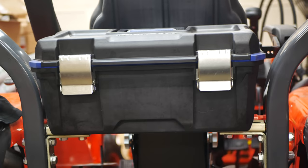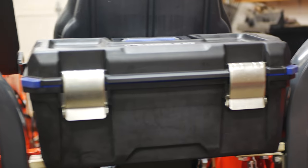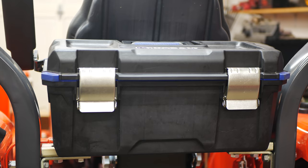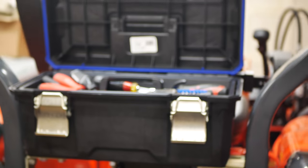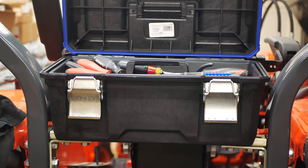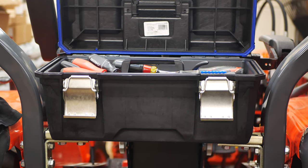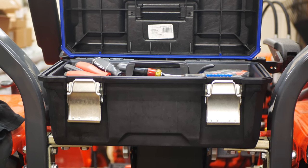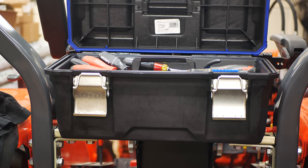There's the Mako. It's sitting on there just about where it needs to be. I have tools in it right now, so I've got to knock the tools out, but I set and placed it so it could easily be opened up — the lid would open to a 90-degree angle before it hits the seat. I'm going to make a hold-down with some angle iron, drill up from underneath through the unistrut, which will give me my template for the holes on the angle iron, and then bolt it all down and finish this up.